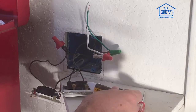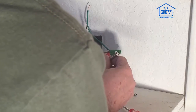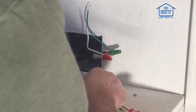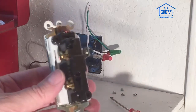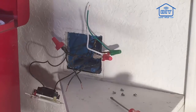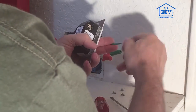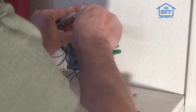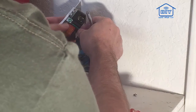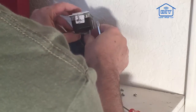We need a small jeweler screwdriver for the quick release to take those wires right out. On the back of this switch you have a little quick-connect clamp right here — you just reach in, jiggle it loose. Time to wire it in. First thing we're going to do, make sure the wire is not frayed at the end. Push that all the way down in there and close it off. Give it a little tug. The white wire goes to the silver screw — nice and tight. Don't over-tighten it or you'll strip it out.